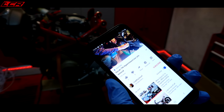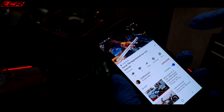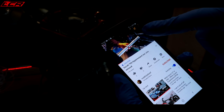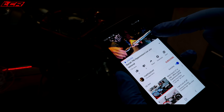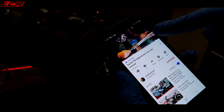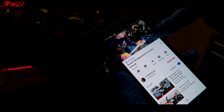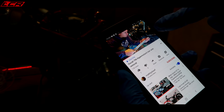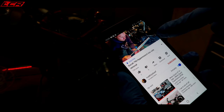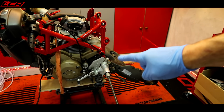This is the video which was very kindly shared with me. They've done the same thing - a bit more sophisticated than mine. They've put a tube piece of external tube, the threaded bar goes in the middle, and then basically that screws into the thread at the other side. You can then wind on it and draw the bolt out as opposed to beating it to death. That's what I've attempted to recreate here.